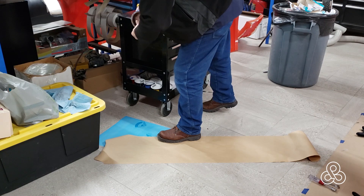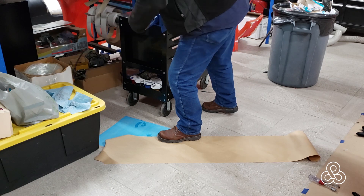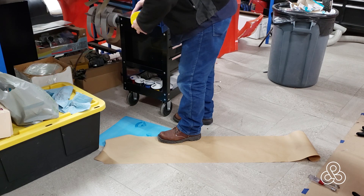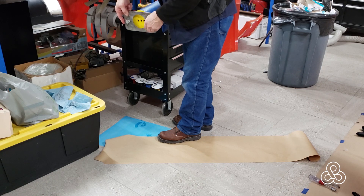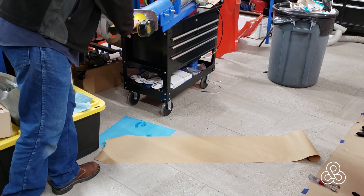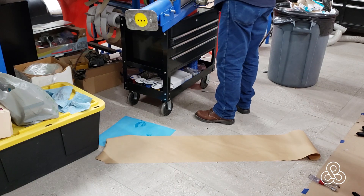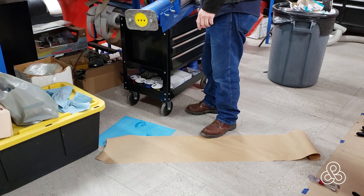Now once the flashings are in place, we need to do our fillet wax. I actually use a clay — it seems to stick a little bit better — but now I've got miles worth of fillet clay to do. So back to the extruder — instead of rolling 100 miles of snakes, load up about three pounds of clay in the extruder. Put some air to that big old cylinder. Make short work of rolling snakes.